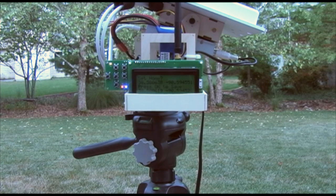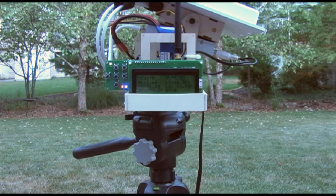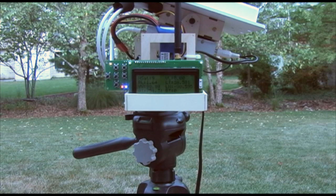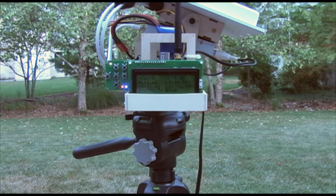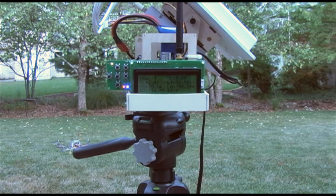Hitting the center button will save the home position of the antenna. I need to bring the ArduCopter over and hold it near this position, then set it when I get a good GPS solution. We're seeing about eight satellites right now. The GPS position moves constantly — the more satellites you have, the better the position. Also, the closer the altitude is to your survey altitude, the better the antenna will operate. Now it's showing nine, then alternating between nine and ten satellites — that's pretty good.